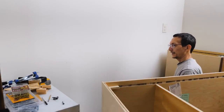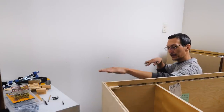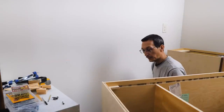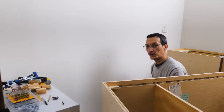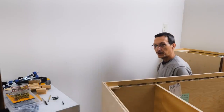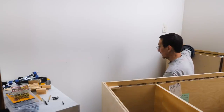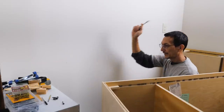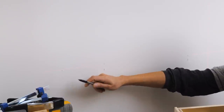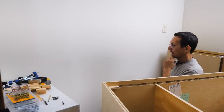First, find your top line — where the top of your cabinets needs to come to be consistent, because floors differ. In this bathroom the finished floor is already installed, so I don't have to account for floor thickness like in the kitchen. I measured up from the floor 34 and a half inches — the height of the cabinet — on each side of the wall. I put the laser line right on my 34.5-inch tick mark. The tick mark on the other side is lower, so it drops about a quarter inch. Always go by your highest tick mark — that establishes your level line.